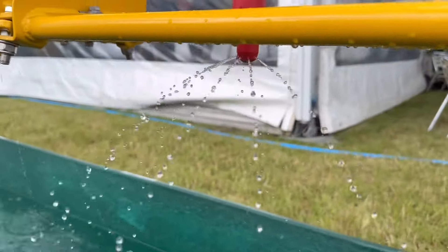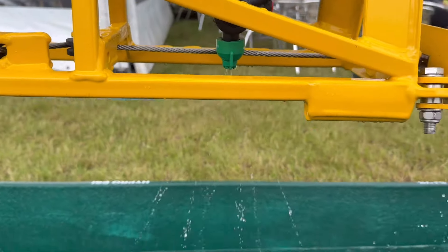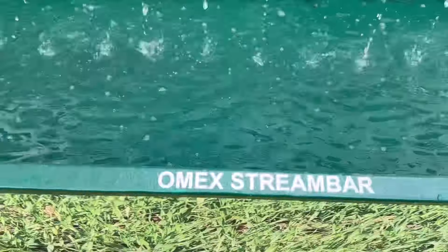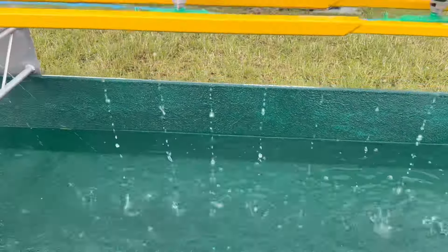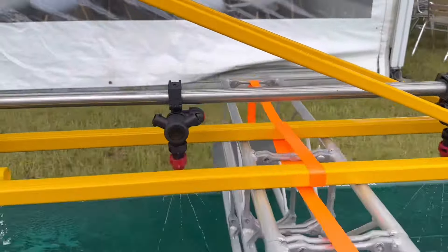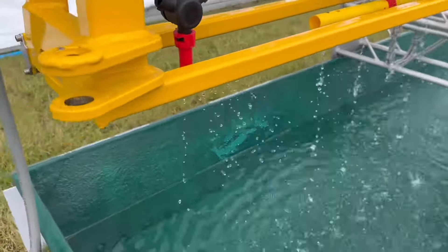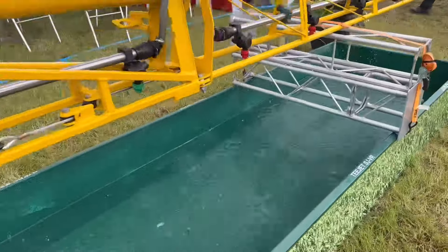You've got one putting it out like an umbrella. High-pro nozzle there - so we've got T-jet putting out through water, T-jet there, high-pro there putting it on like that. Then the stream bar or dribble bar as it's called - this is what we use. You can see that's putting a nice big coarse droplet on, very even. Then a smaller droplet nozzle, and Bateman also do a type of nozzle similar to the Omex one, and there's another umbrella nozzle.